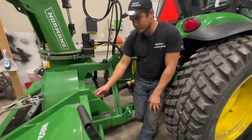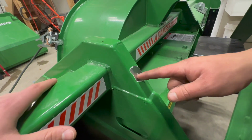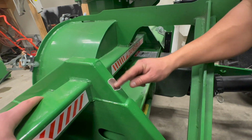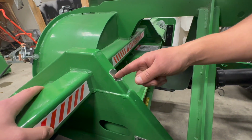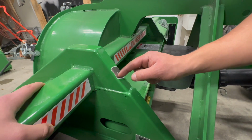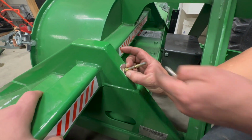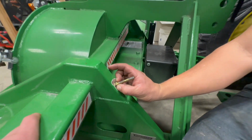Also in here, as you can see, what I did is I mark where those holes are gonna be, right? And on both sides, and to be able to have a mark well done, you need to grind as well. I just use a drill bit, just a little bit, then I grind it, and then the weld is gonna work better in there, right? Right in the center of that mark in there, weld around, and that's where the handle of the shovel goes. Okay, let's see it.